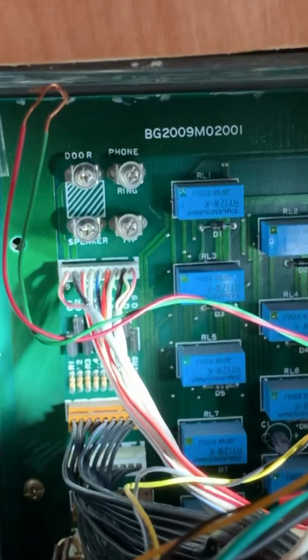I've still got some on order. So I've got the wires off the door speakers, and since there were 2 on each, I was able to determine that the ones I want, the ones going to the front door, are determined by the chime, and the little yellow wire going down there to the right one is the front door chime. So this yellow and green will go to the power supply. Red and green, the 2 wires that I put onto the power supply right there.